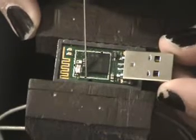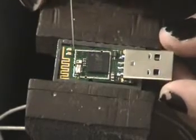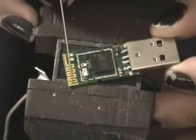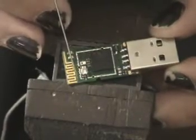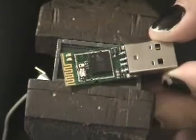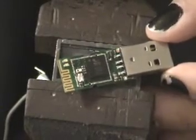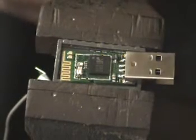But if you notice they have these little holes called vias — they just lead to the bottom side of the board. They also have this nice silver bead of solder all the way around that can be used for your ground. You can just take your coax and solder it, but you have to make sure that you actually sever this wire and pull away the signal from the antenna. You'd take a razor blade or this pick and scrape away until this track is completely broken and the antenna is deactivated. Use the pick to scrape away the green lacquer and then tin this solder track — but be very careful. Don't use an insanely hot soldering iron because the heat conducted into the track could make it burn straight off the board. This adapter is very difficult to modify; I'd stay away from it if possible.